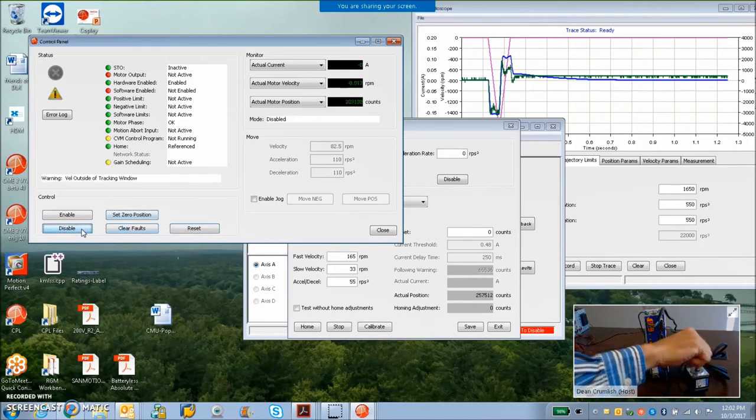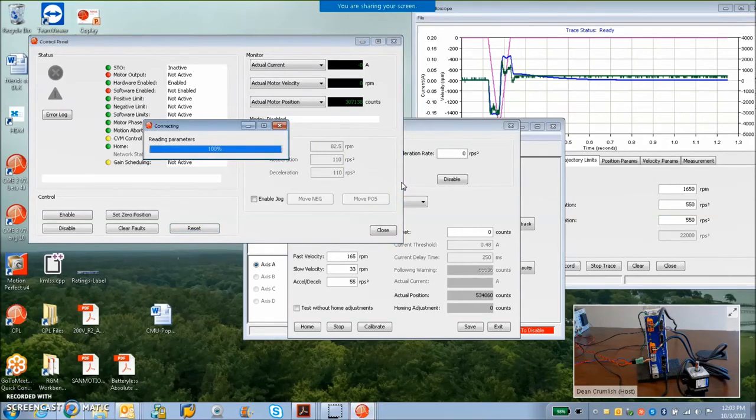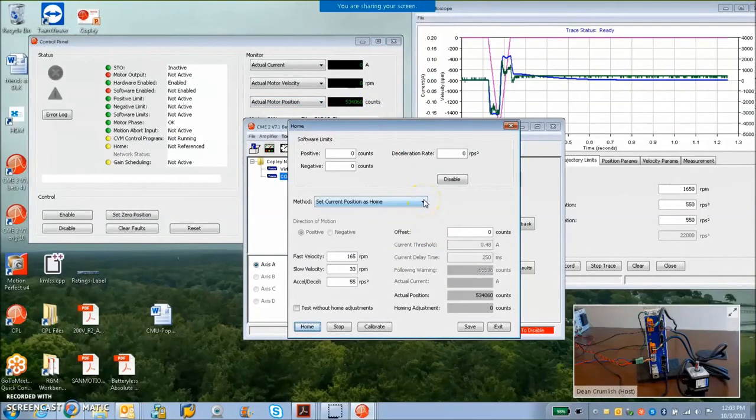So when I power up or reset, it's just purely the absolute position reported from the feedback device. No calibrations, no offsets. And so now we can see, yeah, there it is. No homing reference, and that's the position reported from the encoder. So, go back and do the absolute immediate home. Move it to where you want to move it. Put in the correction value here. Save it, and then execute the home and reset the drive for a test, and you'll see that it works.